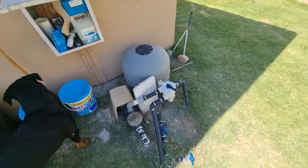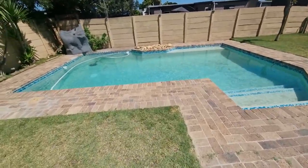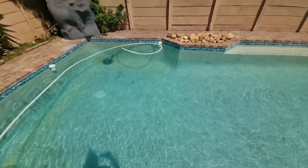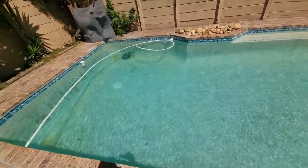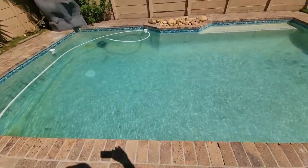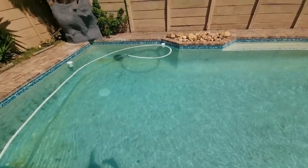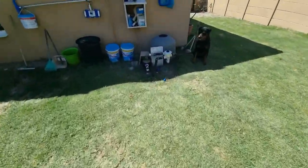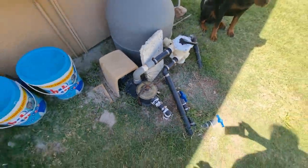But in the back of my mind I'm thinking I just replaced the sand, it cannot be that. So winter just passed — we let the pool go green. Beginning of summer I bombed it with chemicals, got it right again, threw in alum, let the dirt sink to the bottom, sucked it out with the vacuum to waste, and then the pool was great. I checked for air hose leaks and even siliconed the suction side — you can see the white silicone around there. For the life of me I couldn't figure it out.